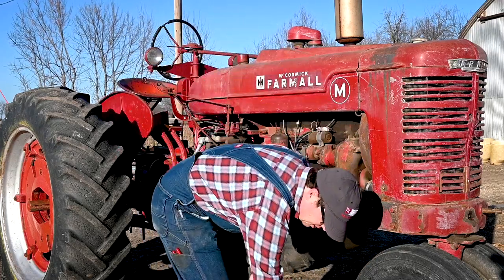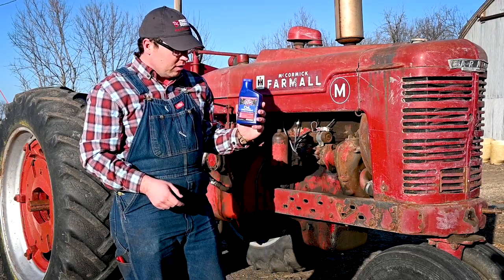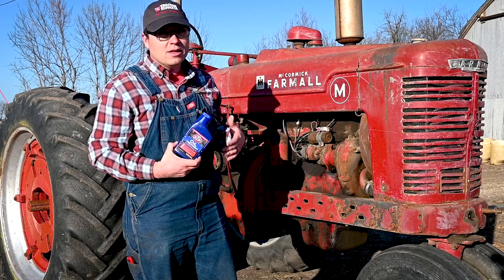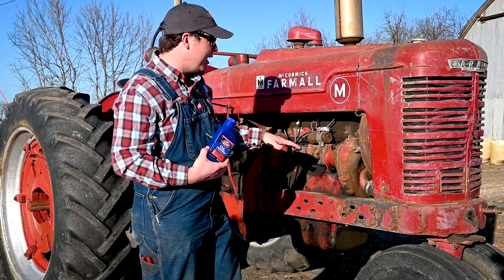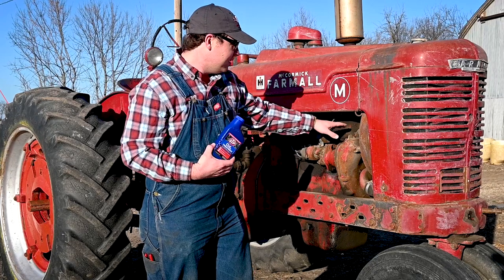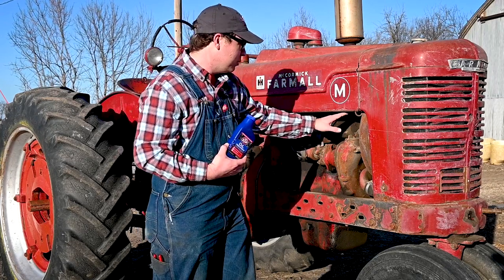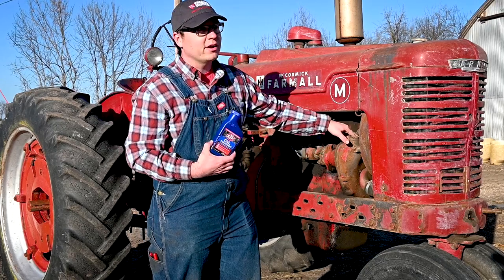And I'm also, not knowing the life of this engine and what's happened to it, gonna put in some of the STP oil treatment just to know that it's got the lubricants to help with the cam and all that in here on these old engines, as these were not engines built to work with modern oils that we're seeing now with a lot of the synthetics and whatnot. They want all of the dinosaurs, as Derek from Vice Grip Garage would say. So that's what we're gonna try for today and just get it serviced so that we know we can trust it out here all winter.